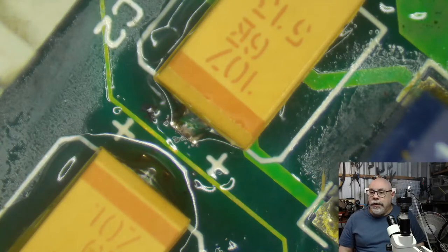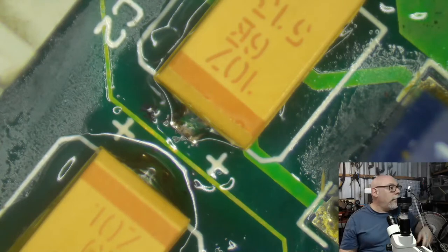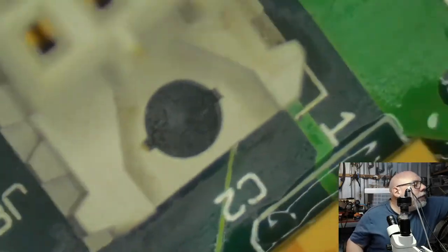I don't actually do a RAM upgrade, but the important thing with the Mac Plus when you do an upgrade is you do need to cut a resistor on the logic board in order to do the upgrade. I've got one here actually, just here. That's the SE. This is a Plus. So just going to jump across here very quickly.